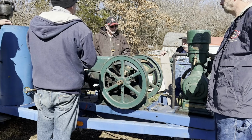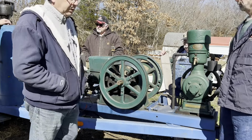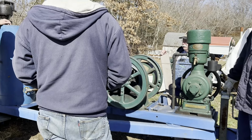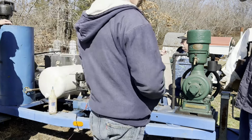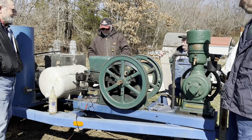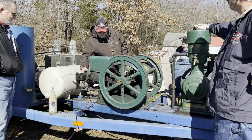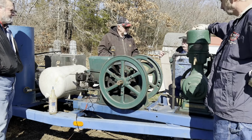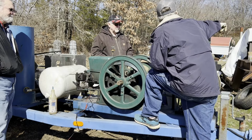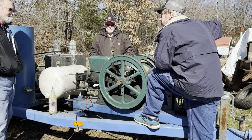You got your gas rag? Yep. You do know about using gas instead of ether. Don't use ether. Use gas, a little bit, and just crank the hell out of it. Well, I can't get my Cummins started without gas. Right. We were in the excavating business here, my dad did it and my brother and I took it and went on with it. I saw guys use ether and blow them up. Gasoline, a little bit on the rag, it'll crank them. One cranked up when it was so cold, 22 degrees, and it cranked with nothing.